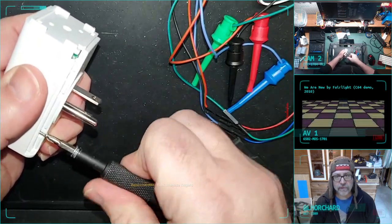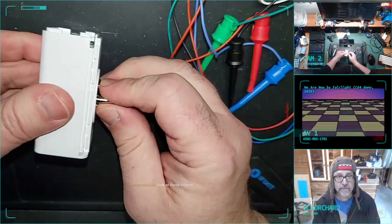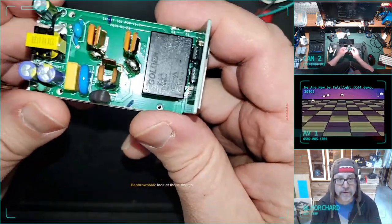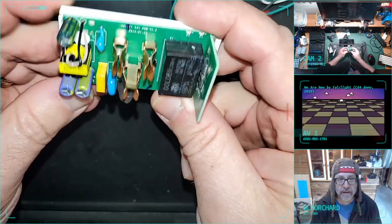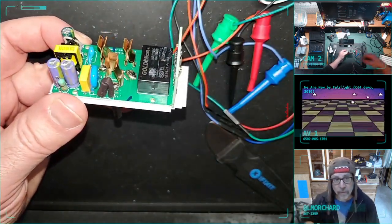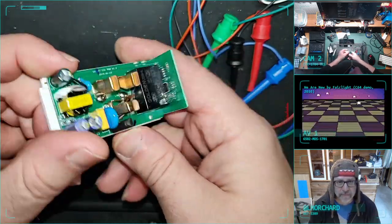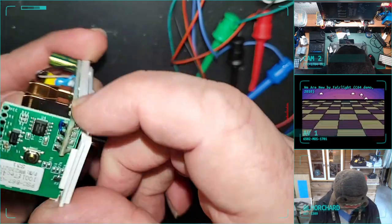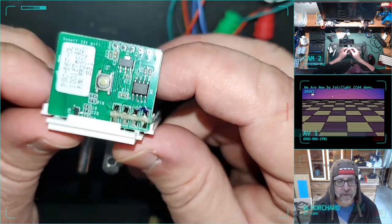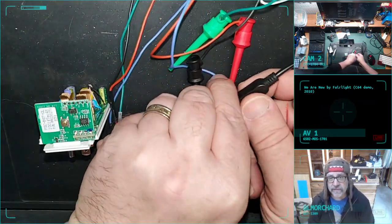All right, last screw. And then, yeah, this thing just pulls out of the housing real easy. Another little tour of the guts. I think most of this is just trying to siphon 3 volts off the wall power. And I'm pretty sure the microcontroller's on the underside of here, although, no, I actually think it might all be in this board. Anyways, another little look at this thing. Here's the programming button. Here's the serial pads. I'm gonna unplug my serial interface for now.